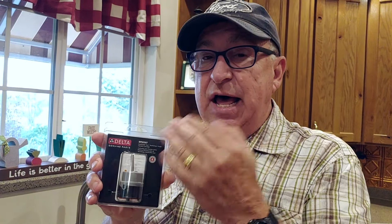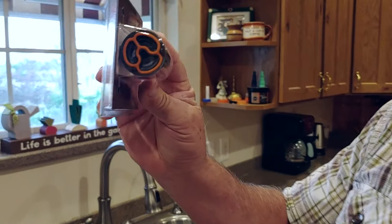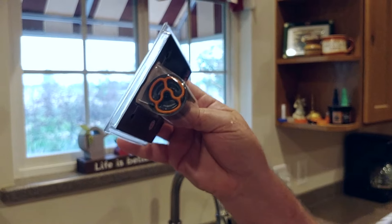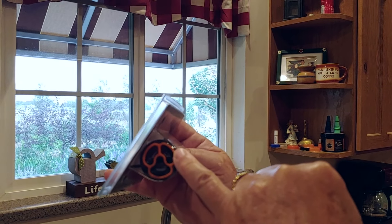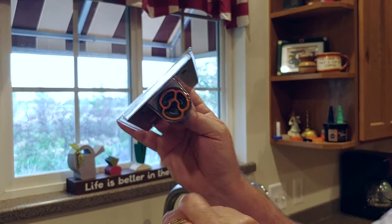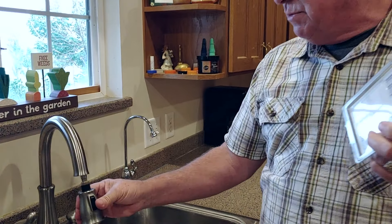The materials now are a lot better than they used to be — there are ceramics in this, some really high-strength plastics, a lot of good wear surfaces. If you look at the bottom of this, it almost looks like a monkey in a gas mask. One side is the hot water inlet, the other side is the cold water inlet. This whole area up here mixes them in the proportion you call for, and then the water comes out mixed at the temperature you want, back up the pipeline and out the spout.